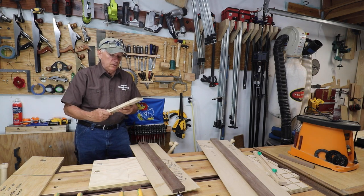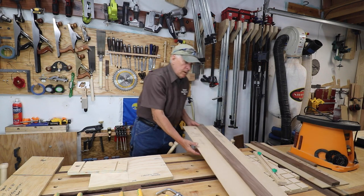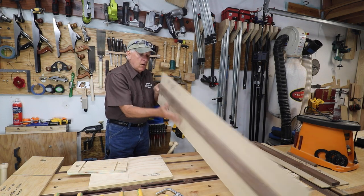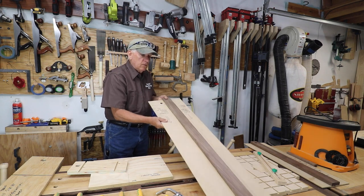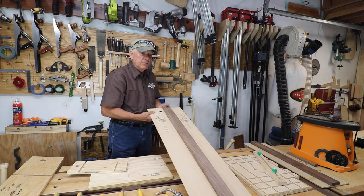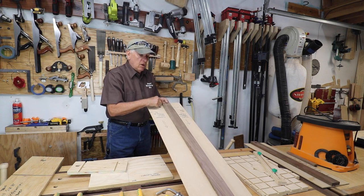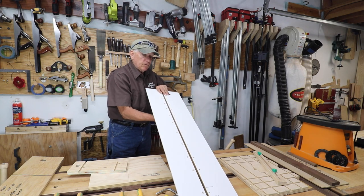Another simple jig is a guide for my two different circular saws. This concept uses just the dovetail slot. I fortified it with some screws because once you cut that slot all the way through, you've cut two pieces separate and there's not a lot of surface for the clamps to hang on to the guide. So I cut the guide — they're separate pieces — and then fortified it with a lot of screws.